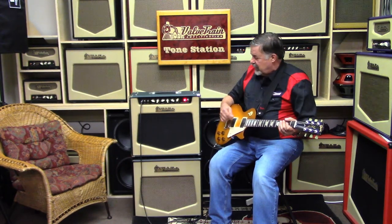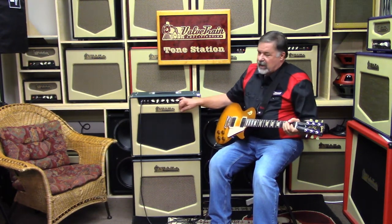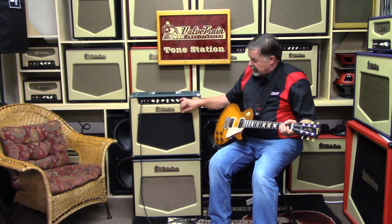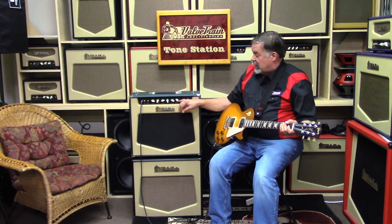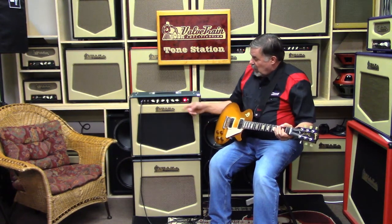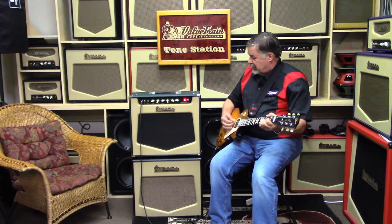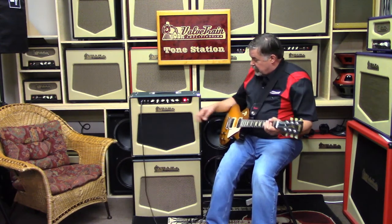The governor can be switched in and out of the circuit. Because of the fun that our camera has with automatically leveling all of our sound pressure levels, you aren't going to hear it clearly, but it drops the sound of the amp back. Maybe what you can hear is how my voice is actually coming up above it. You can use the governor to tune the amp way back, bring the gain up, and then use a foot switch or the front panel mounted switch to activate raw mode, which is a fun trick all of its own.